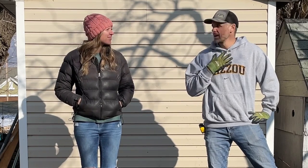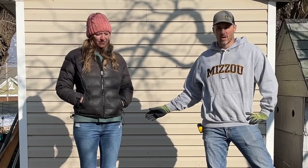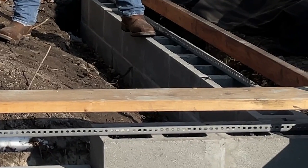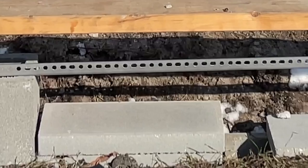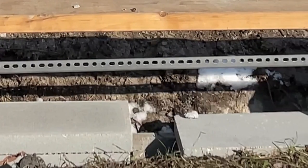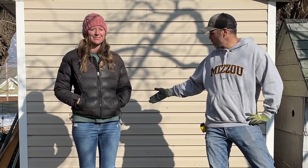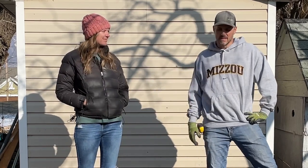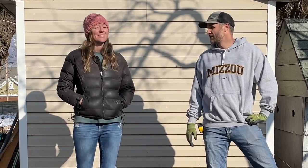You can't hear me great because I don't have my mic on, but we have just a couple of steps before we can actually start putting brick on top of our block wall. We're going to put down a little channel and secure that to give our back edge of brick a little more stability. We have some capstones that we need to mortar into place for our doorway, and after that we will lay out our courses right here on these two upright vertical white pieces, and then we'll just start laying brick.